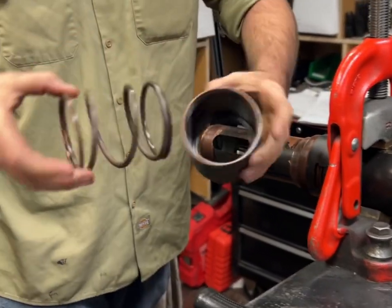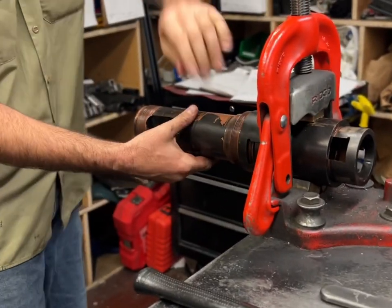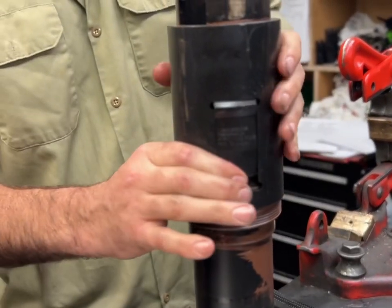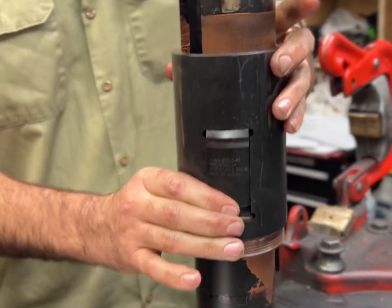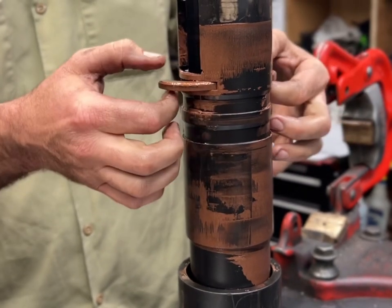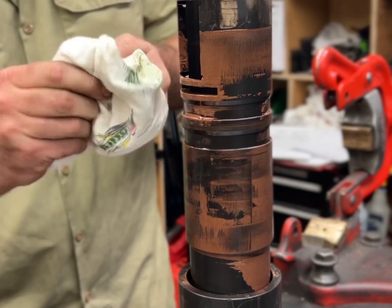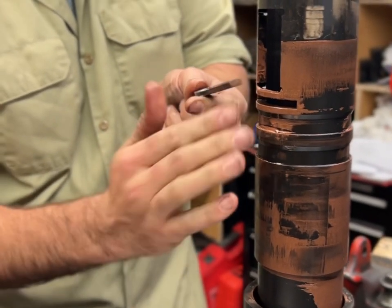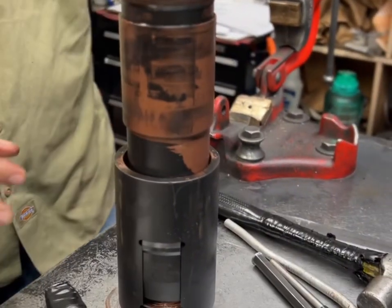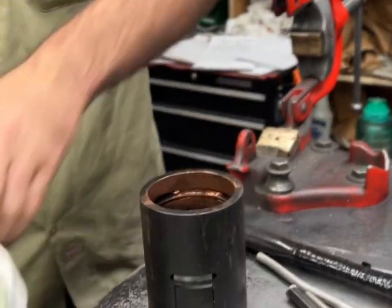Core spring and your spring retainer. And you pinch the back of the dog, just come up with it, drop it down, should release. You got lug segments here. The lug segments go in a certain way. The angles should be up in this way. We'll do that on assembly too. So pull this out. The bottom mandrel.